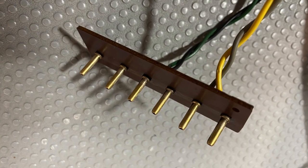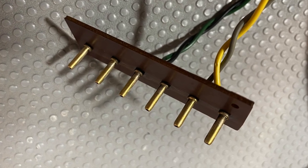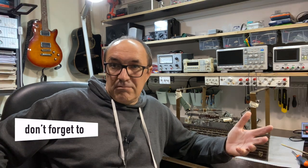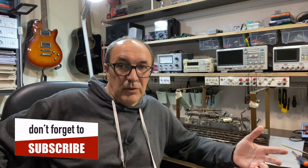With this particular radio, I'm quite confident that it's going to be very, very good because of the two separate output transformers for stereo. This thing's got speakers inside the console, so there's a sort of tag strip, like a plug-in strip, that is outside. When you put it into the console, your speaker wires get plugged in there. That same socket connector has got two pins for the gramophone power, which I'm going to disable, because the gramophone that this thing's got is just going to be cleaned up and left there as basically decoration. It's not going to be used at all.